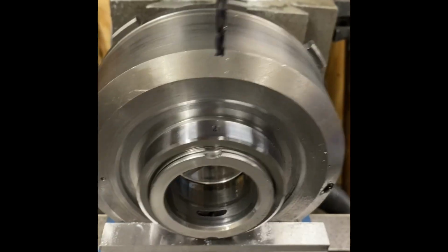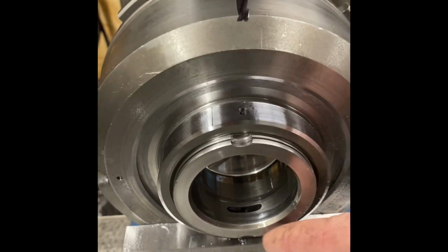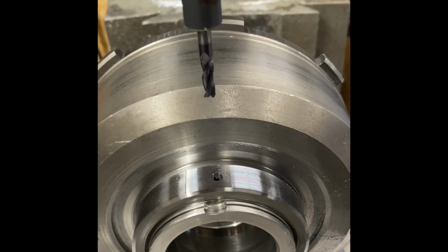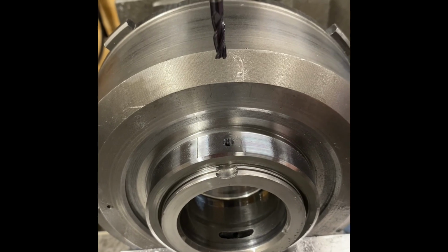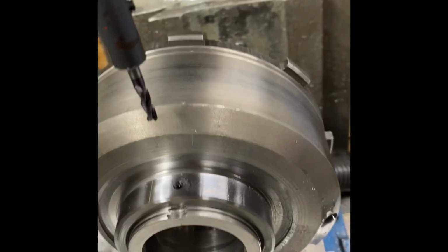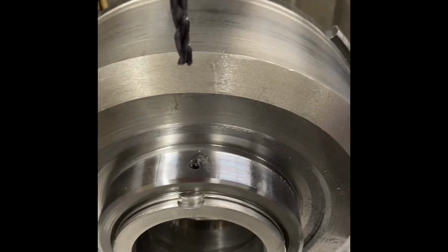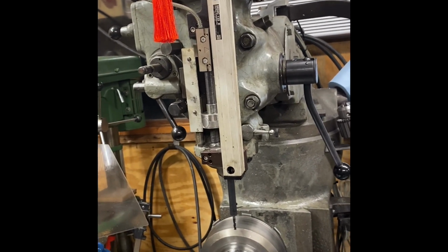Comparing it off a 4L80 or a Turbo 400, they have basically the same size on each side. So I'm going to try this. Just do one side. And it'll pretty much get lubrication when it's free spinning. When this clutch is engaged, this should be free spinning. And then when it's not getting lubrication, it's engaged and shouldn't really need it. That's my theory. But I have it set up in my end mill or my milling machine.